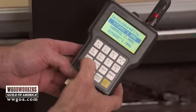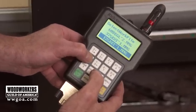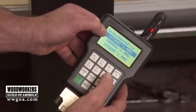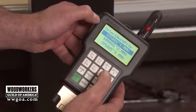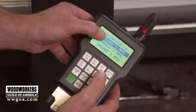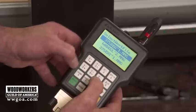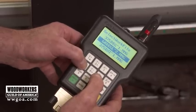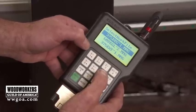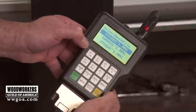And when we go in there, this is a listing of all the files that are available in the shop sign. Now remember how I said I like to name the files with the cutter so that when I get here, I know what I'm doing? This is why. 375, well that tells me I need to have a 3/8 bit in there in order to run this one. A 60 degree bit to run that one. So that helps me just keep track of what I should be doing. I'm gonna close the dust collection door and we're gonna be ready to start running this.